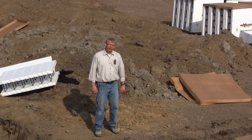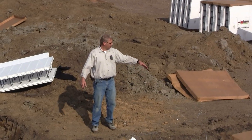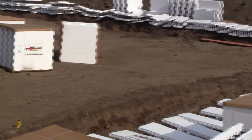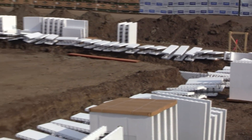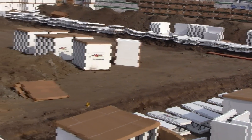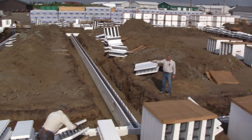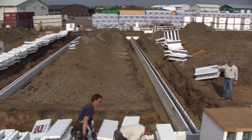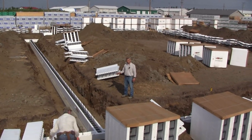We just finished row number one on this shop. The main body of the building is 8-inch block — we started on that end and worked our way across. There are 564 lineal feet of wall being built here. The front section is 6-inch block, the demising wall is 8-inch, and the other area is also 6-inch, which will be office space. The first row took us half an hour with eight guys.